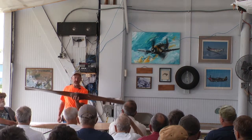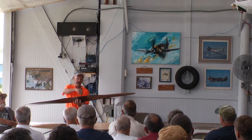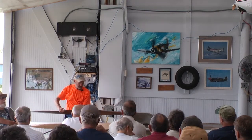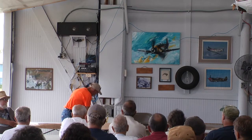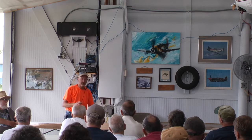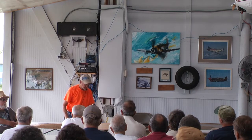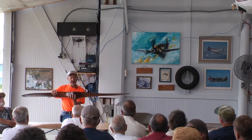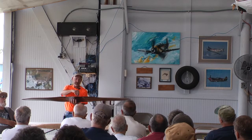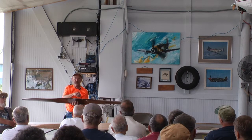So I have this propeller sitting on that sharpened steel rod, and if, let's say it's off, I cut off little hunks of lead and place them wherever needed in order to get this to lay perfectly level again. And you can buy various kinds of little bubble level things that you place on the top of this, and that gives you your balance information in both axes, bubble going each way. So you've got it sitting on your pointed 1/4-inch steel dowel or rod, and I cut off little hunks of lead and placed them in a position whereby the top of the propeller would be perfectly level again. That way I knew exactly where I needed to put my lead.